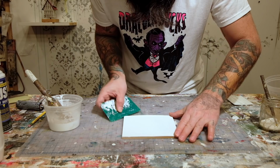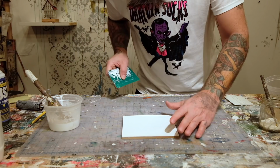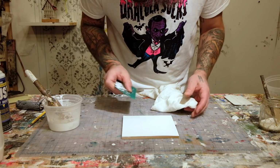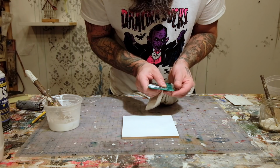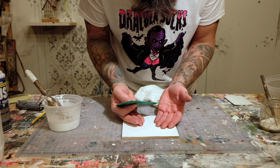Another thing I like to do is check my edge, especially when I go over the edge of the wood like that, it could catch little bits of glue. I tend to use a rag or a paper towel or something. It's good to hold on to one of these and give that extra wipe down in between. Prevent you from contaminating your paper. And working from the middle to the edges, get out any possible air bubbles, which is a great enemy of yours.